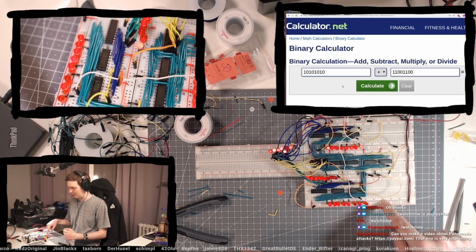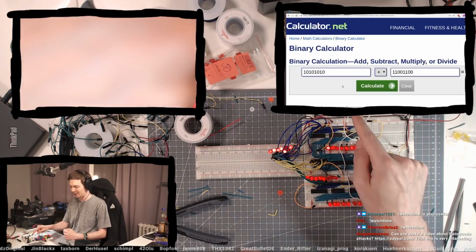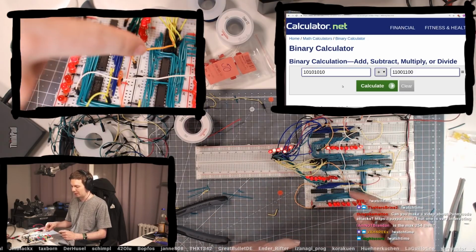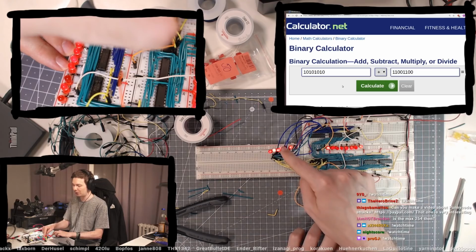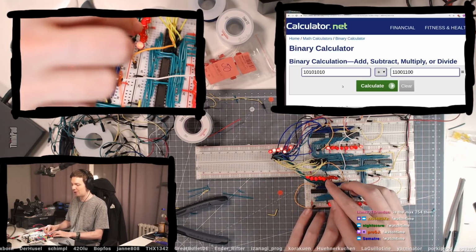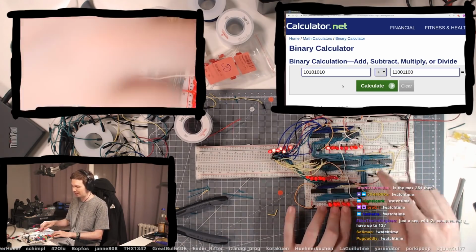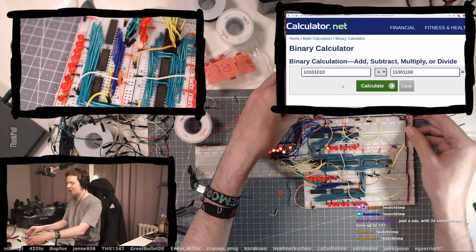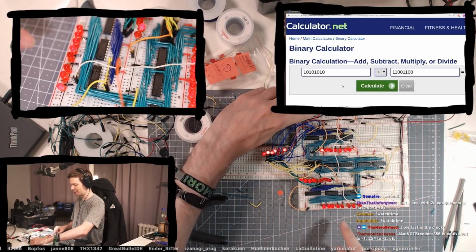And the B register right now is set to read its value from the bus with each clock cycle. But that is the result that is in there. So with each clock cycle now, the ALU is constantly doing this value in here minus one, and the result is put out onto the bus. With each clock cycle, it will read the result back into the register, which means now on the bus, the result is minus one. With the next tick, it reads that value in, does the minus one, puts it onto the bus. With the next clock cycle, it will put the new value into the register. The ALU will perform minus one, put that onto the bus, and then we have the circle. So with each clock cycle, we should be able to consistently cycle through these values. Basically, minus one constantly executing.